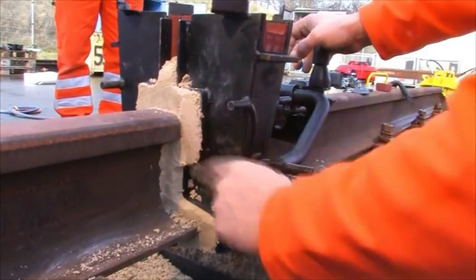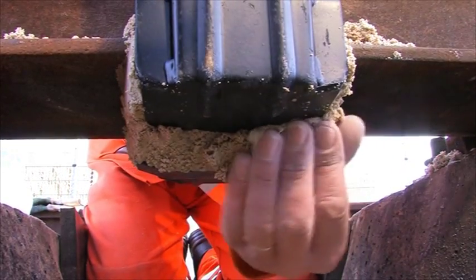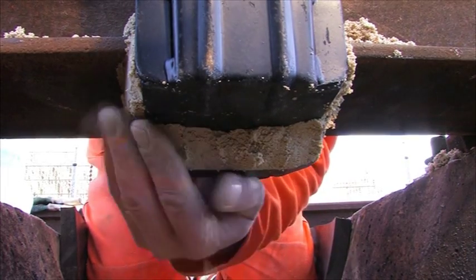After sealing, the rail heads left and right of the joint are to be protected. If hot welding sparks meet the cold rail head, then a fatigue fracture may develop on these points.